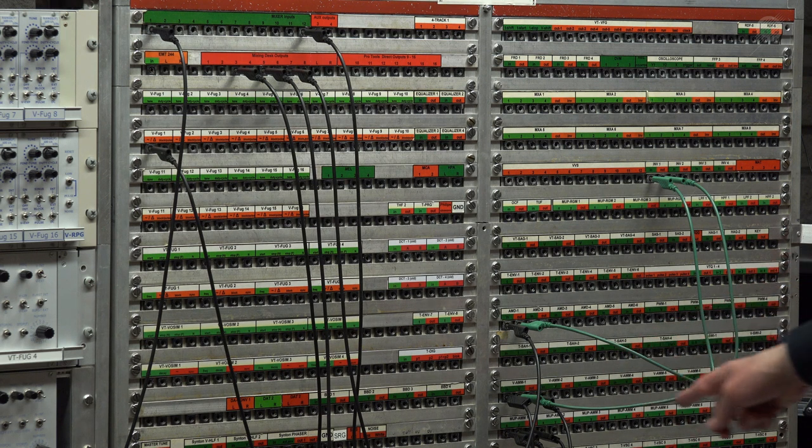The amplitude modulator receives the inverted voltage from the amplitude demodulator. The output of the amplitude modulator goes to the mixing desk. Then it is patched to the reverb, and the reverb is coming back on the mixing desk and is brought to a group fader, which then goes to the third octave filter, and the third octave filter is feeding back to the mixing desk. So that's the whole closed loop.